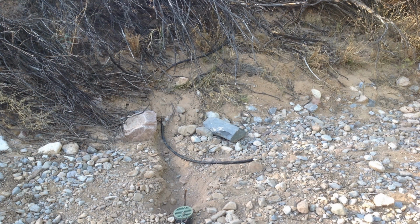One of the reasons we went with a gypsum block was to create a low-profile sensor that would be less susceptible to damage during a flood. By burying the sensor next to the bottle, it was protected from gravel or boulders that might be carried in a flood.